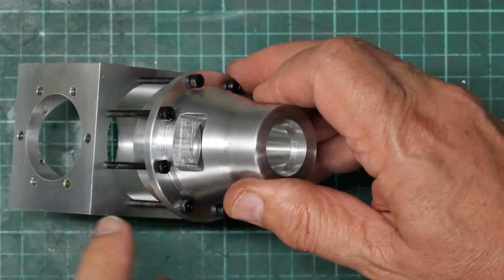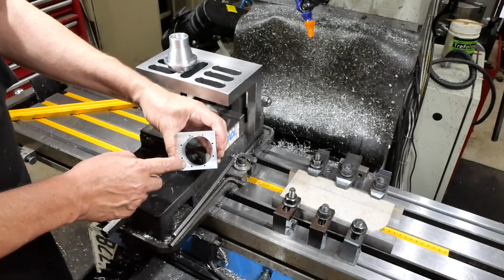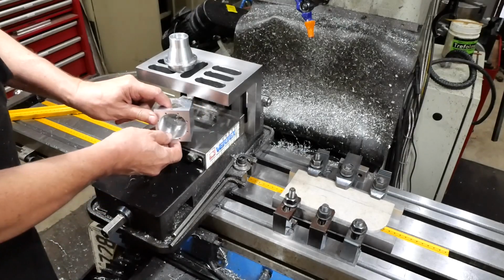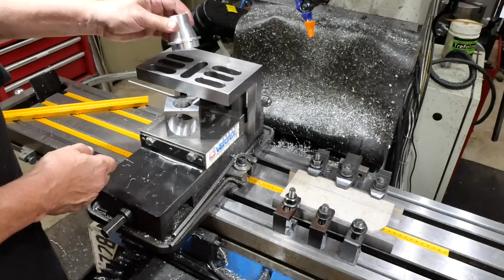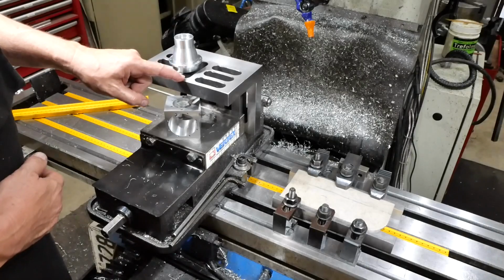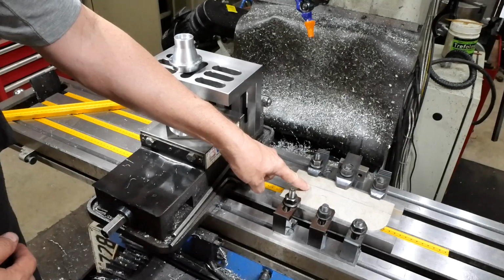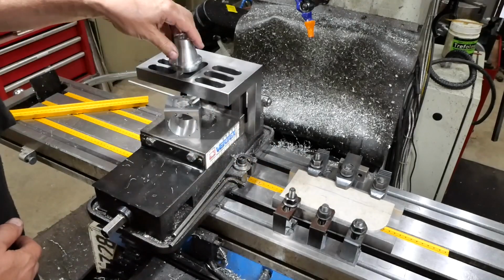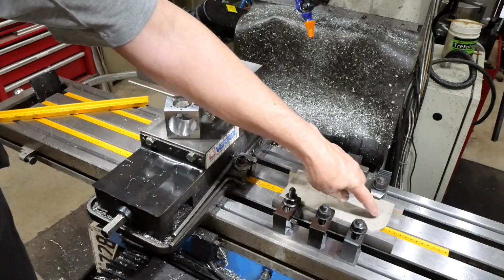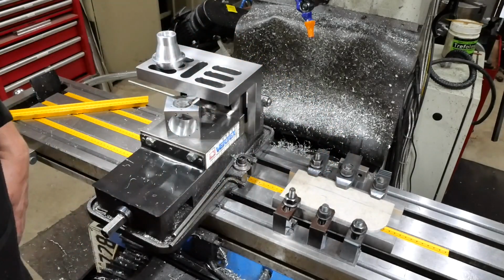Anyway, now it's time to make the cover plate that will fit on this pattern. So it's a 61mm diameter disc, 3mm thick. And as you've already seen, it has a bolt pattern that matches what we've already got here. Now, my first idea was to try and... Oh, and I've got a piece of 3mm sheet, I don't know whether you'd call it plate here, scrap anyway, which is big enough to get a piece out of. But I want to run a smoothing cutter across both faces just to clean it up a bit.